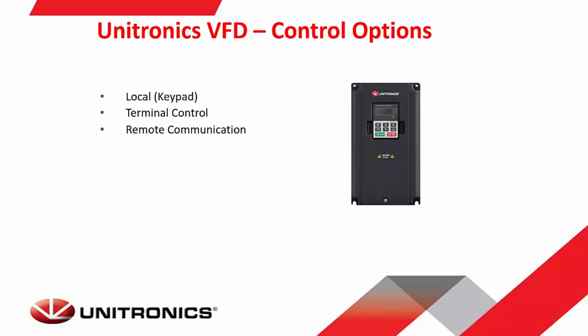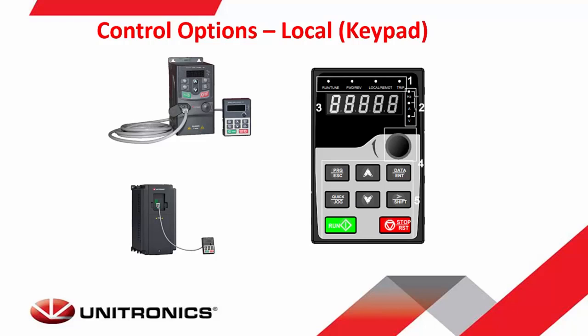So let's talk about our control options for these VFDs. You have three main ways to control. First would be local with the keypad. Then you can use the terminal inputs. And then you finally have remote communication. For the keypad, you can see here, you can have external keypad, which can be mounted separately from the VFD. On the right, number one, you'll see your indication LEDs. This will tell you what the state of the VFD is.